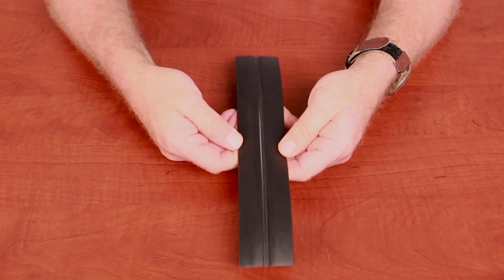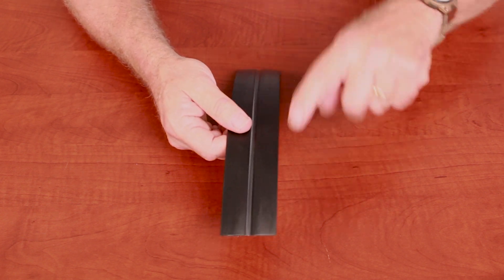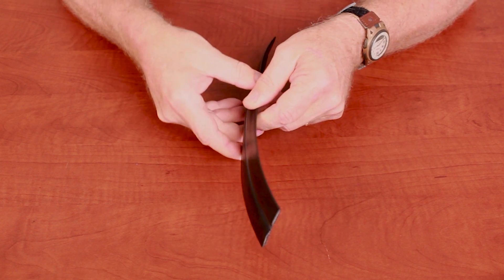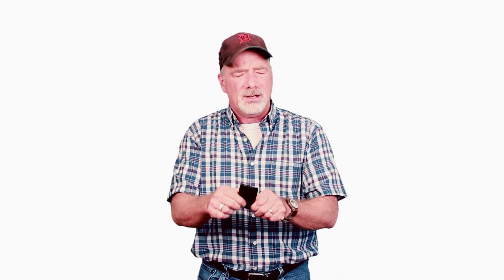There's a newer product in the hinge world, and that's called the plastic living hinge. Like a lot of names in the hinge business, I'm not quite sure how it came to be called a living hinge, but we think that's because the hinging action lives within the part itself. This is a piece of plastic that's been extruded — meaning the hot plastic has been forced through a die — and coming out of that die, it's been given a very special hourglass shape. The outside plastic is thick and strong, but in the middle, the plastic has been thinned to create the ability for the two parts to hinge together.